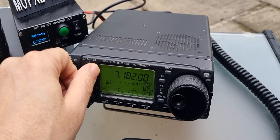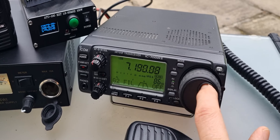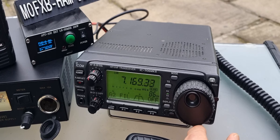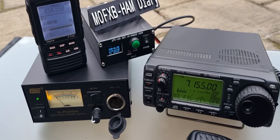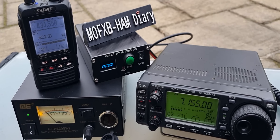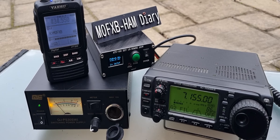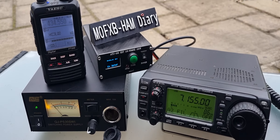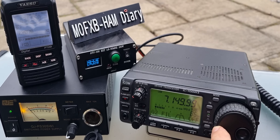Let's have a tune through HF. With wire antennas, if you get a good balun they just work well. It's not a great setup, just a couple of wires strung across the garden - I haven't grounded anything here - and it just works well. If I want lots of contacts I'd ground it better, but generally I'm a listener with the odd hello. That's what I love about 40 metres - always lots of good ragchews.